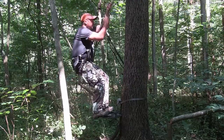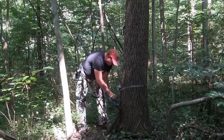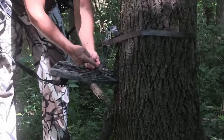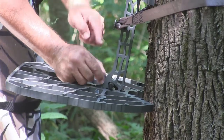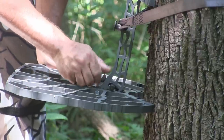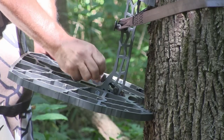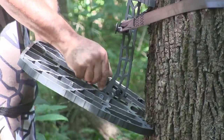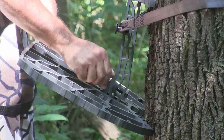So, let's jump down and show you this angle adjustment thing they built in here. So, this is kind of nice. If you zoom in here, there's this little rod here that goes through. It's actually pre-drilled and threaded. So, it's actually on this threaded bolt that I can turn here. As you see, as I turn this threaded bolt, you'll watch that thing walk up here, and that's what allows you to push it on down, or you can walk it backwards. And now, you push it all the way to the end, now it's angled up. So you go from this angle here to, if I walk it all the way up, I can actually cant this down, as I've talked about and spoken about all through this video.